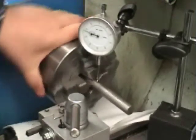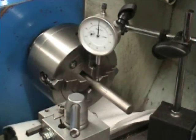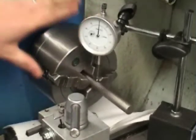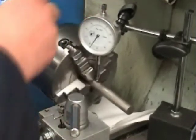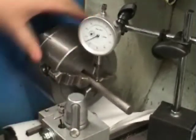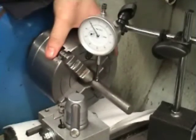The process is quite simple: you find the high spot. I could zero this dial indicator by adjusting but I'm not really going to be too worried about that. If you notice that's gone down and that's gone up, so the highest part is about there. We look at the jaw that's at the highest part, immediately go to the other side and loosen that off a little, because it needs to pull against that jaw. So as we've loosened it off a little we tighten down and we look to see how we're doing.